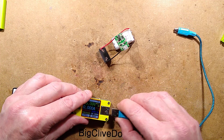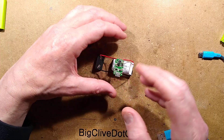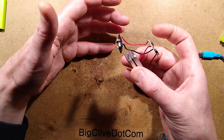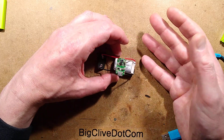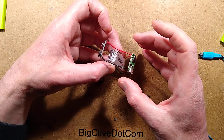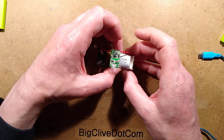There's the little red LED showing it's charging, which will go out when it's charged. Quiescent current in standby: if you put this into storage, I would estimate it would be about six months before the battery was flat, because the quiescent current tested at 222 microamps. That's just what it draws to keep the circuitry active. So it's not something you'll take out of a drawer a year later with a charge - it would be flat by then. It's more suited to regular use, like in a belt pack on a wireless microphone, where you'd be charging it before use. A little level indicator would have been quite nice, but that is adding too much into a small space.